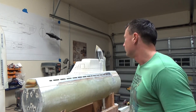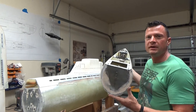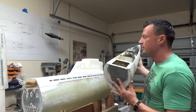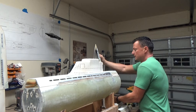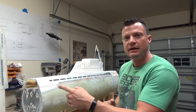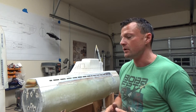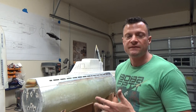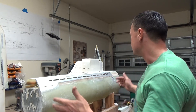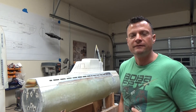I have sectioned off the hull. As you can see, the hull is now in three sections. I'm going to work out an attachment point — these bulkheads were already in place, so I'll utilize those. I'll install some brackets in the main hull, with three bolts on each side, and I'm hoping to use wing nuts so you won't need any tools. This was done primarily for transportation convenience. Instead of something eight and a half feet long, each section is about three feet, making it much more convenient to transport to and from the pond.